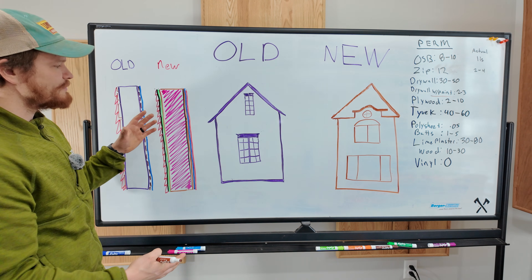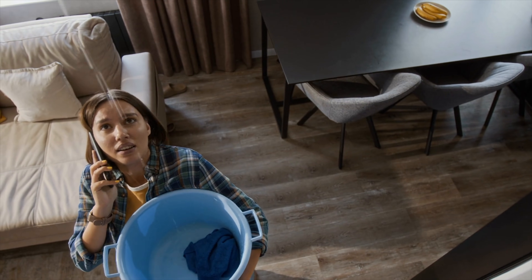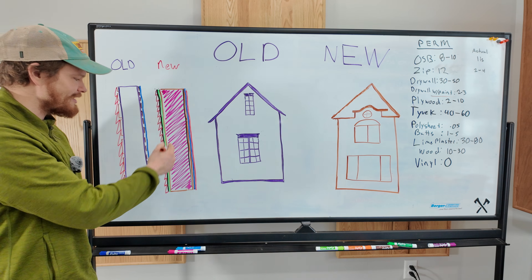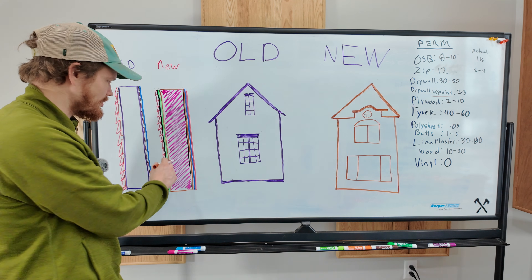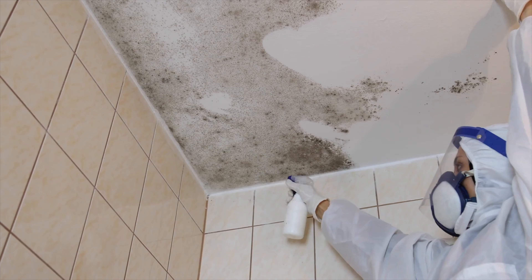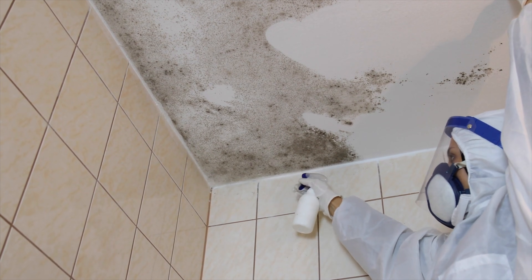Whereas with the new style of building, if you do get a leak — and at some point every house is going to have a leak — that air is not moving around, and it's also not able to move through a bunch of these different products. So you're going to be stuck with a dark, damp environment, and that is what mold loves.